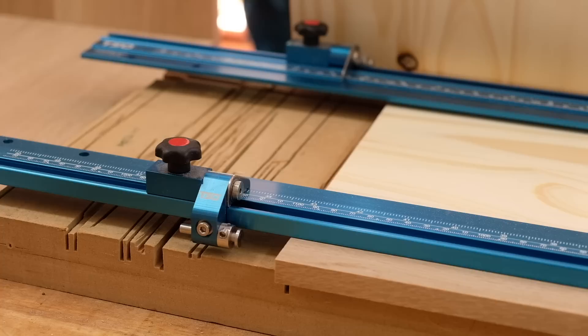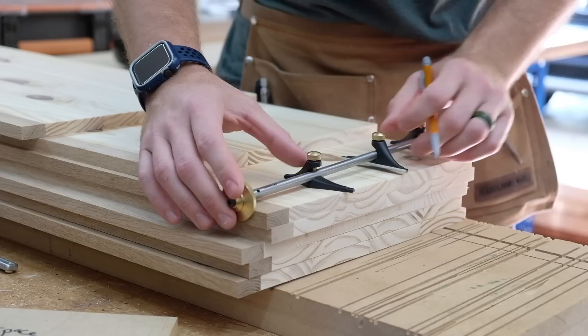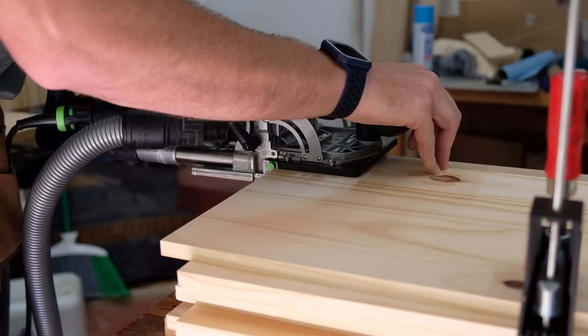Off camera, I prepared my vertical dividers using some pre-made spruce panels, and I prepared them the same way as the other panels using the track saw. I also added some oak edging about an inch to an inch and a quarter's worth, and this saves a decent amount of weight relative to using solid oak throughout. To minimize how many dominoes I used, I got this story stick from Lee Valley to mark lines on the vertical dividers. From there I can cut the domino mortises, and for these pieces I'm using 4mm dominoes.